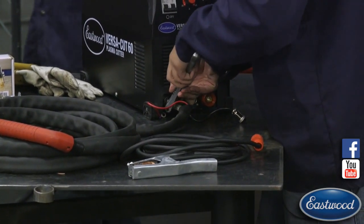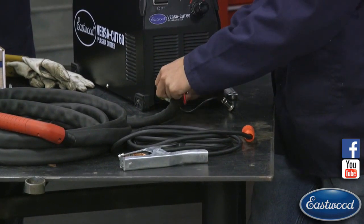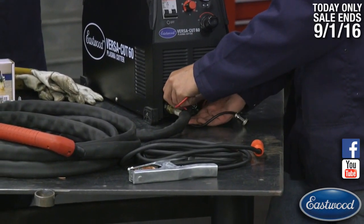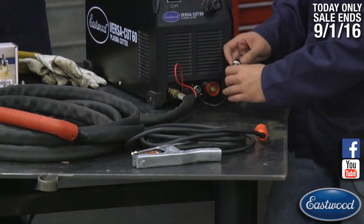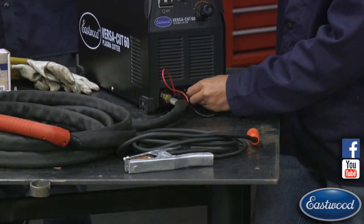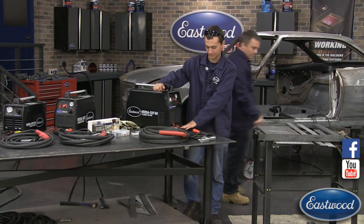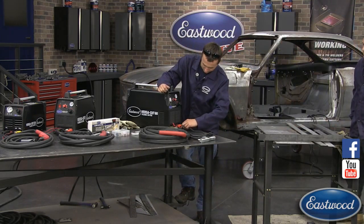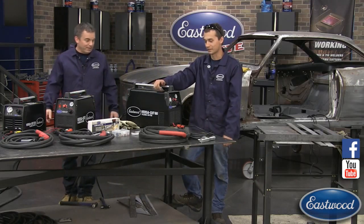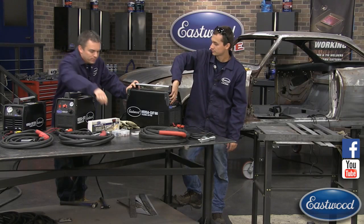Don't forget, if you have any questions just post them — Scott will answer them. This is our daily deal today, a huge cost savings, so visit Eastwood and click the link below the video. Don't forget to share because we're giving away the Eastwood guy starter kit — welding jacket, gloves, and plasma shades. Now we've got our torch connected, pilot arc circuit connected, and torch switch connected. All we've got to do is connect the ground clamp — it clicks in, then you turn it 180 degrees. The entire assembly takes about a minute or two and you're ready to cut metal.